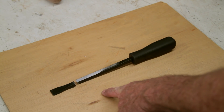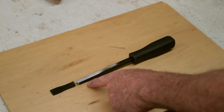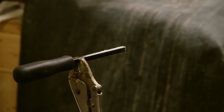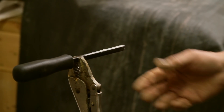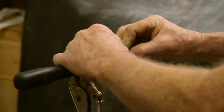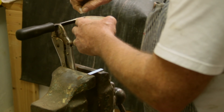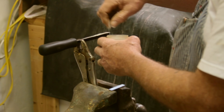For making the Big Ugly — or actually call this a Little Ugly tool — pick these up at the local Harbor Freight, they're about four bucks a piece, it's a pry bar. Cut the end off using an abrasive blade in the circular saw, and then take this to a belt sander and clean all the paint off it. This was something that my friend Randall came up with. We're going to modify a Harbor Freight pry bar, cut the end off, take all the paint off, make sure it's nice and clean, and then it's the same process as before. I already put some silver solder flux on here and here's a piece of the silver solder tape.